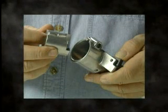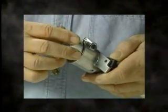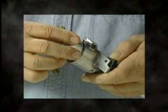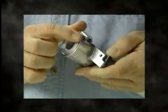After selecting the proper bushing, the WS5A tool can now be adjusted for end stripping. Install the bushing in the tool by lining up the rib on the bushing with the slot on the tool body. Raise the cutting blade by depressing the outer edge. Push the locking pin and insert the bushing until it locks in place.